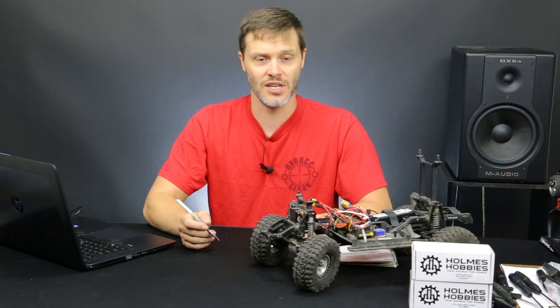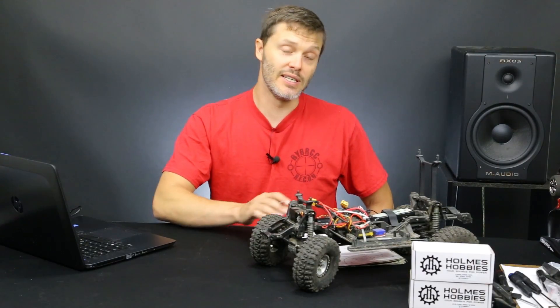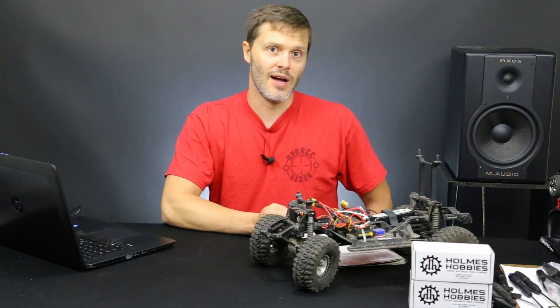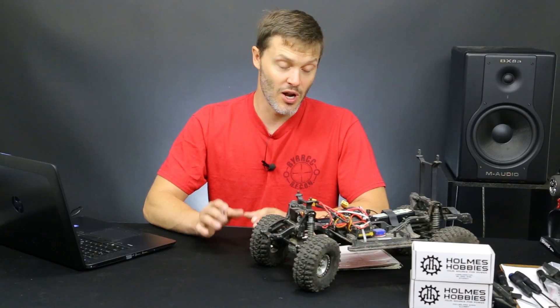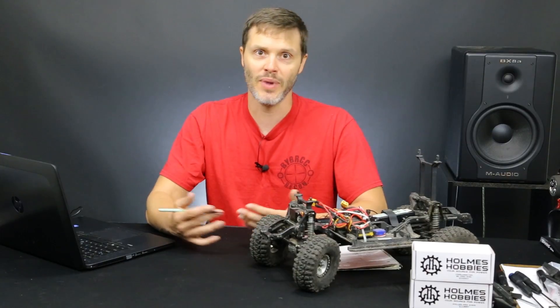We already have a motor that's known to be smooth starting. Essentially, the motor has to be designed for good low speed control to begin with, and in my case I try not to compromise anything else. Hobbywing came out with a new staggered pole motor, and when you do things like staggering the pole to try to get smoother startup, you do lose efficiency, you lose torque density, and you end up pushing the KV higher while the phase resistance stays the same — so it ends up burning more heat instead of making power. My BLE controller also starts up well. We did some changes to it that Castle has ended up using on their controllers as well — we have a back-and-forth relationship in that way.